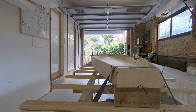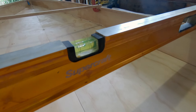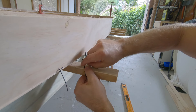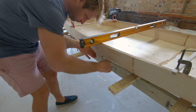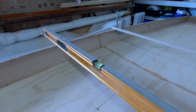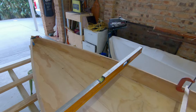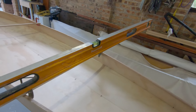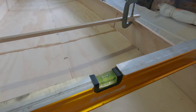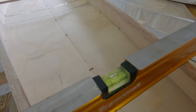Before we glue it together, we need to make sure that the SUP is level. Taking my long straight edge here, lying it up across the two panels — you can see the bubble isn't in the middle. To fix that, I'm going to wire down one side first and go across to the other side, wire it down, and make some adjustments to get the board perfectly level. I know my workbench is level; it's just about extending that level form to the top of the SUP. Bubbles perfectly in the middle. I do the same on the bow, putting the spirit level across the two sides — bubbles in the middle — same again behind midships, and then down at the back or transom, and everything's lined up beautifully. We're ready to start joining the panels.